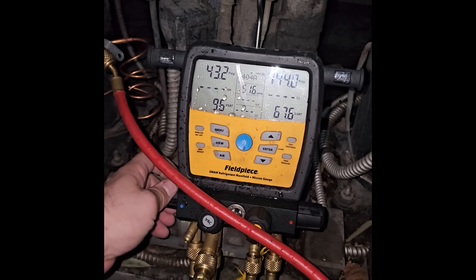It's a cold day so we're having a hard time getting all the refrigerant out of the system — just hovering at 0.5, right around 12 pounds 6 ounces. I know there's 14 in there because I just put it in two days ago. The dryer's all frosty up there and the receiver's got frost on it — we've got oil and we're having a hard time boiling the refrigerant out of the oil. You can tell because when you shut this down, it rises and continues to rise because it's slowly boiling out, but the recovery machine is pulling much faster than it boils. I went ahead and put caps on because these valves always leak on tops — we don't want to be pulling air in through them during recovery.